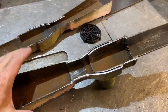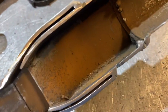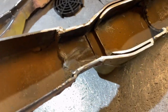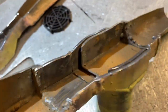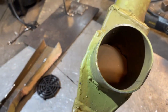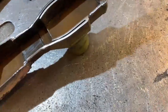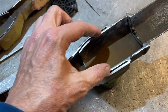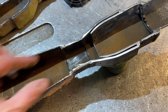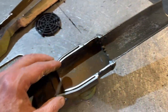So here is what we were looking at. You see this is a poorly designed plenum — that's the worst plenum I've ever seen in my life. I really didn't know what the hell I was doing back then, which is a good thing. If it worked this well poorly designed, we ought to see some astounding performance. Basically this pipe simply fed this tiny plenum that you see. There's a secondary air chamber here. The air from the blower was blowing through this thin slit and coming out this way, making a cone right here, causing a vacuum in this chamber.